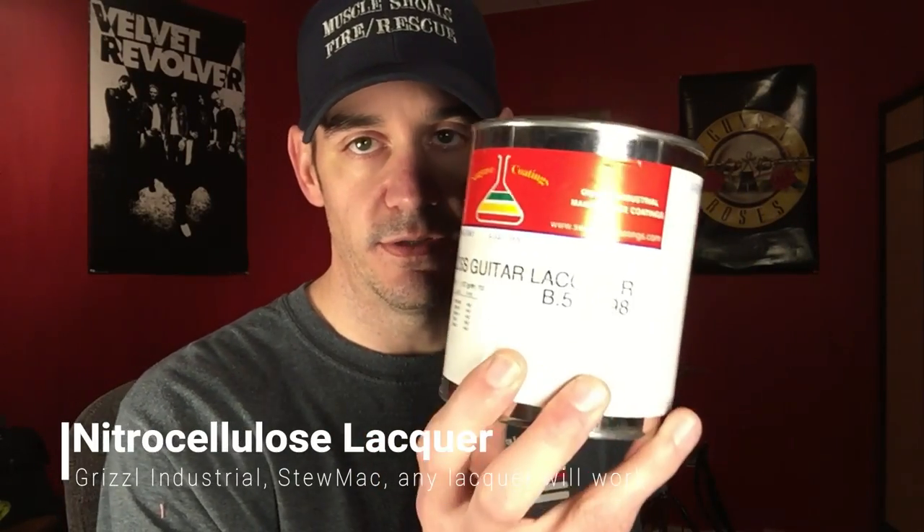The next thing is lacquer — this is a gloss guitar lacquer, and it's what I've been using for these pickups. You can probably use any lacquer or varnish. What it's for is: once we build the pickup with the bottom and top flatwork and the magnets — but before any wires — we're going to dip it in the lacquer, let it sit for a minute, then pull it out and let it hang to dry. That just puts a protective coating over everything — the magnets, the flatwork, all of that.